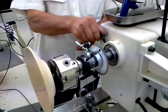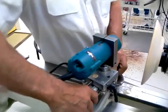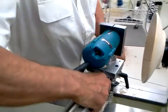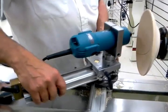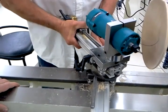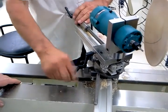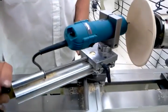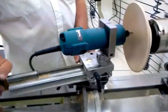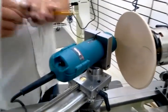Don't forget to pull this pin every time you're doing this so that you don't cut or break your leg. Now he's going to go ahead and lock the router and tighten it down. He takes the brake off so that it will move freely. So now he's adjusted the arc. Let's take a pencil and follow the arc to see how much different it is than the other one.